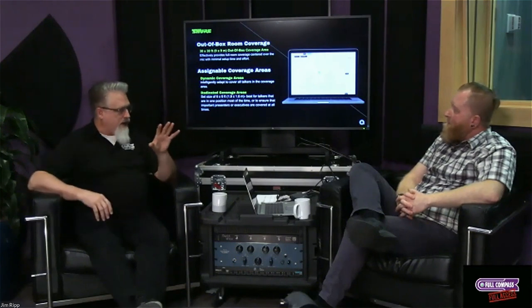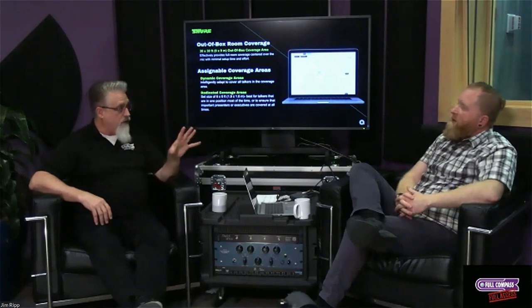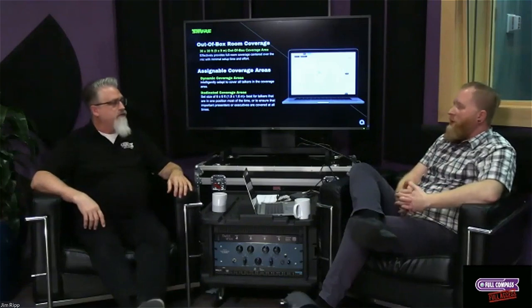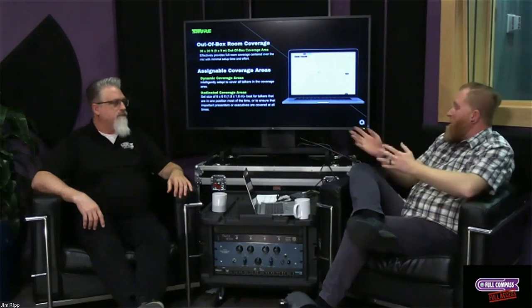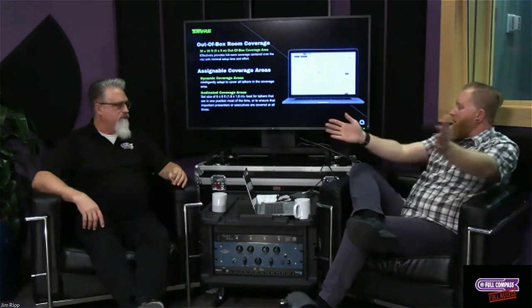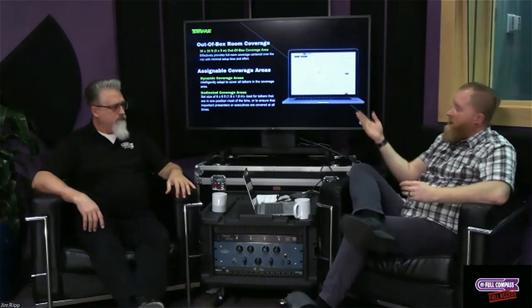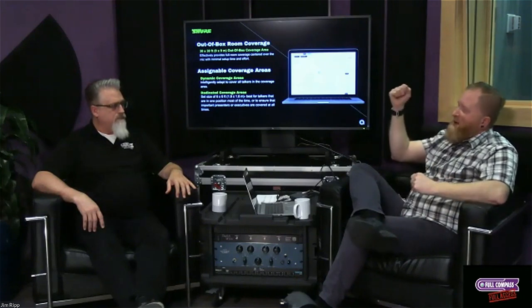So you refer to it as a mic. Yes, a mic. Is it just a single mic, or when you say lobes, are those? Yeah, it's a microphone array. There are different arrays. There was the linear array like we were talking about on the 710. This is a little bit different. That 710 had those slices of the pie we were talking about, floor to ceiling coverage. The MXA 910 and then the 920 to follow, think of it as a flashlight beam.